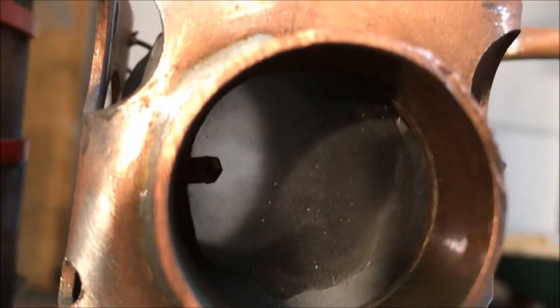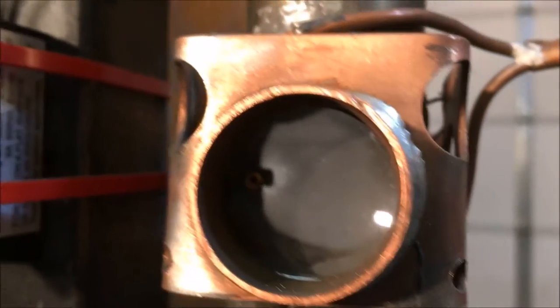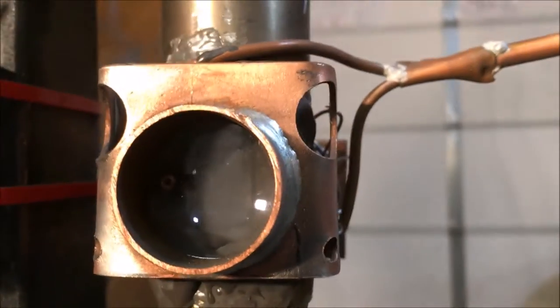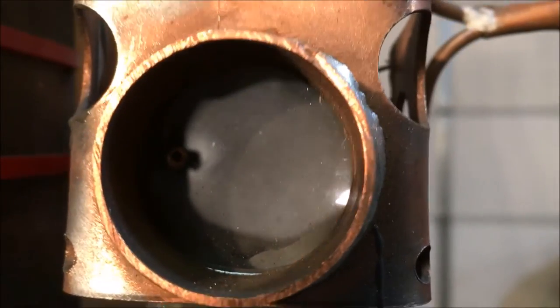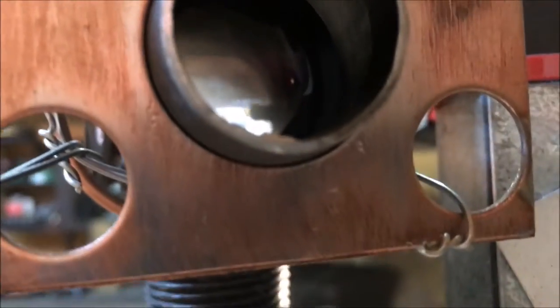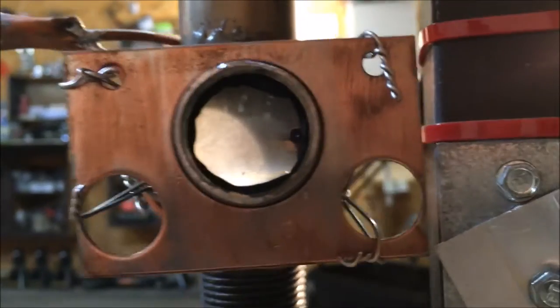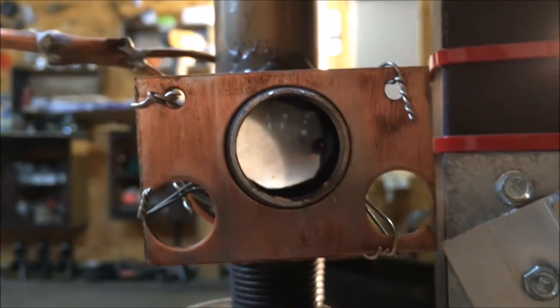A pump of air can clean that glass off. I got this idea from some equipment I've seen in a power plant that I worked in — I do a lot of scaffolding jobs so I get to look at some cool stuff. One of the cool features I noticed on one of their sight glasses was they had a little air connector directly outside the sight glass and two little air spuds. I just thought that was cool and I wanted to post a quick little clip of that idea in case any of you guys have had any problems with your sight glasses.